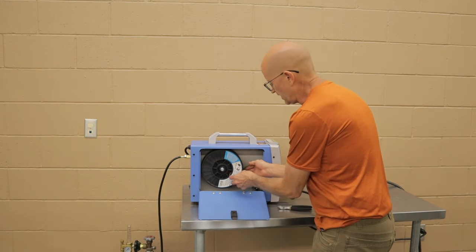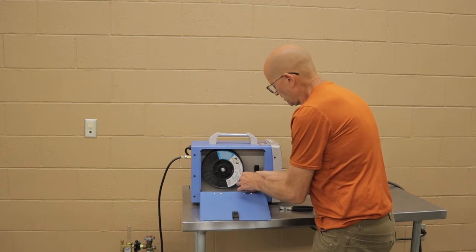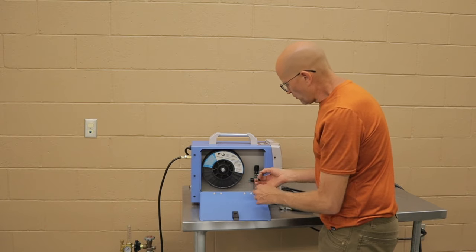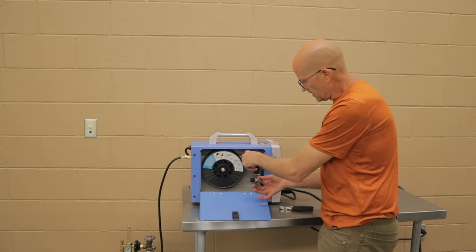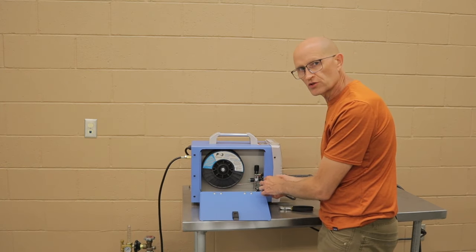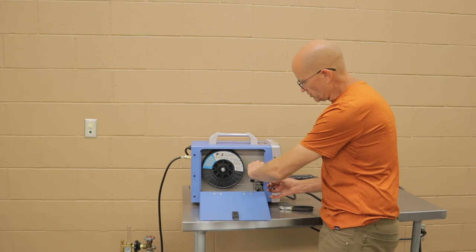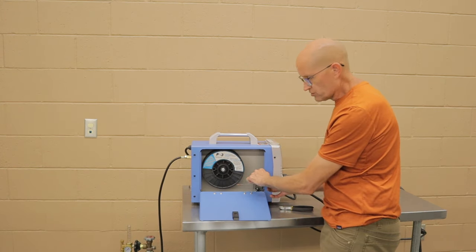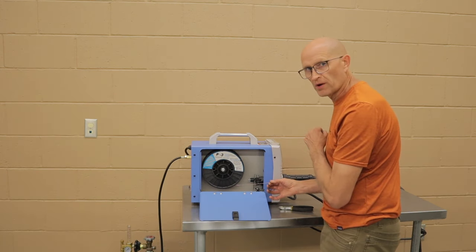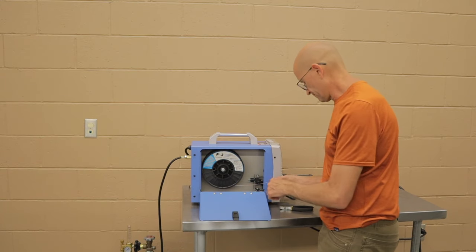At this point, we're gonna take out our MIG wire. We're gonna try and keep it tight so that it doesn't all unravel. At this point, hold your MIG wire and take this knob on your drive. I'm gonna zoom in on this so you can see, but you wanna take your tension knob, pull it towards you till it tilts down, and you'll see that there's a spring-loaded wheel hub right here that will flip up. We need that up because that's what actually drives the wire.